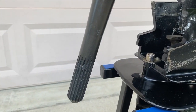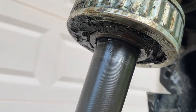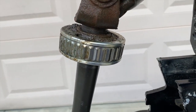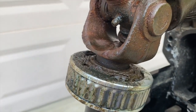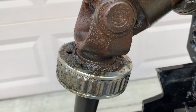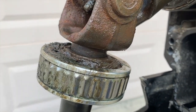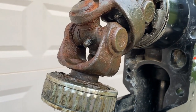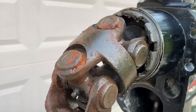I've cleaned the spline area as well as this portion of the shaft, but I have not cleaned the bearing itself. The second cause really could be rust. As you can see, the outer race looks pretty good — in good condition, it looks well greased. However, once you leave the outer race and go to the internal portion of the bearing, you can see it starts to get really dark. The grease as well as that internal portion begins to resemble a very similar color as this rusted-up yoke that houses the U-joints and greasable parts.